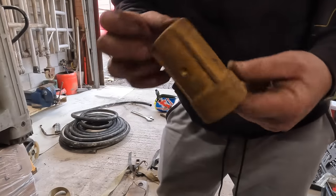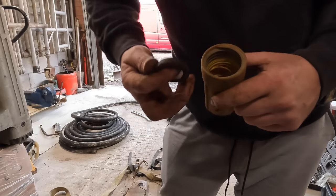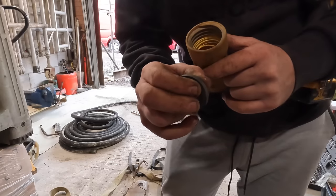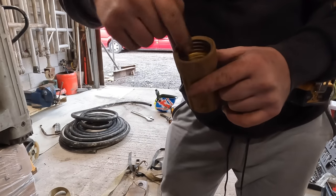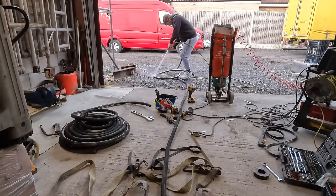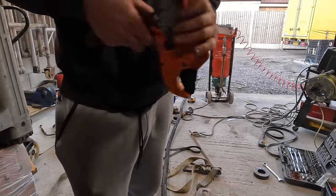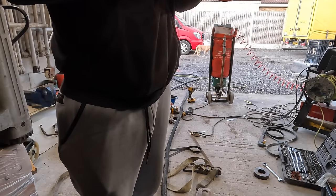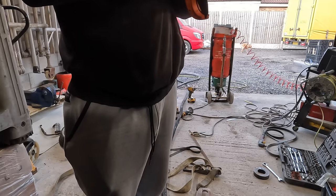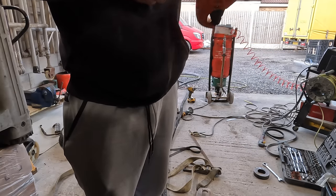And then this is your nozzle holder one. It's near enough exactly the same. Goes on the other side. The rubber inside there sits on the face again. So that sits on the rubber. When you screw your nozzle in, it crunches that up and makes a seal inside there. That's what we're aiming to do here. That doesn't look like it's cut right nice to me, so to save me any headache later on, I'm going to just cut it straight now. Get out, you bleeding thing.